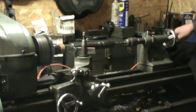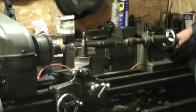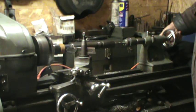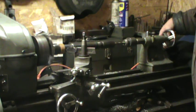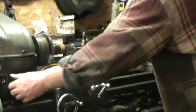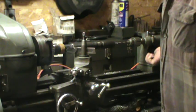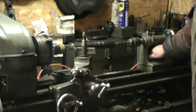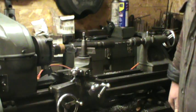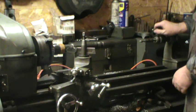We're going to straighten out a few things here while we're doing it — we're going to drill it out. Normally after you drill the three-quarter-inch pilot hole, I like to go about an inch and a half. The tap has a little bit of taper on it, so you've got to go a little deeper than the tap so you get a good one inch of thread there.